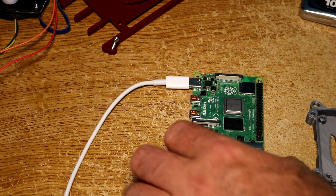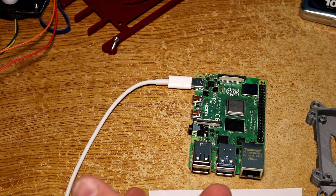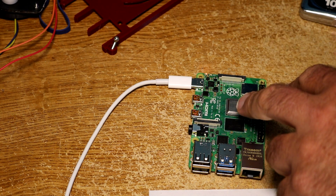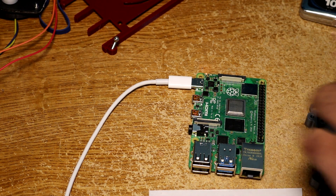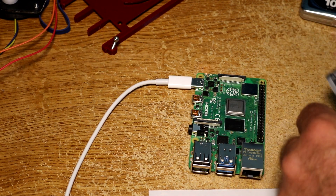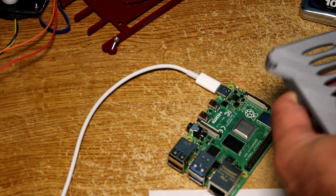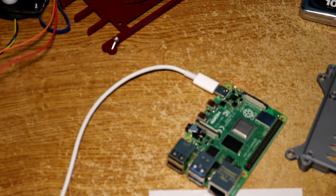So that shows you can put this Raspberry Pi in a PLA case and run it at full CPU load and it will not damage the case in the least. You could maybe get the thing a little bit hotter by running some video, but even at that it's supposed to throttle at 85 degrees Celsius, so it's probably going to top out around 85. Right now it's running about 82 Celsius — didn't hurt the case. When you're talking that 82 to 85 degrees Celsius, you're talking the direct CPU temperature. The temperature we actually have at the case itself is going to be much less because you've got that air gap between the CPU and the case. Even down here on the bottom where there's not that much gap between the case and the PCB, it was still only warm — none of this is deformed at all. Thank you for watching. Please visit my website at www.smbaker.com for more electronics projects and sand rail stuff.